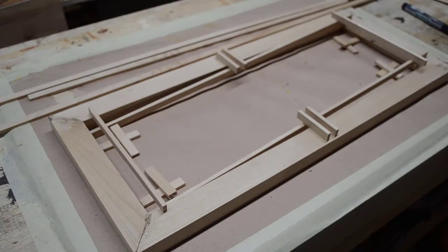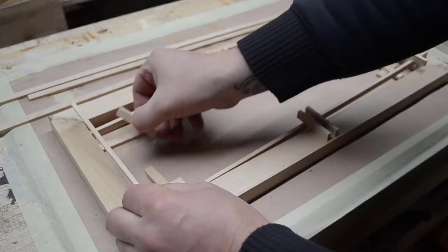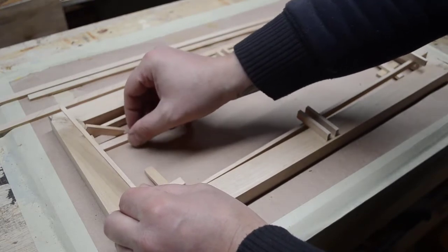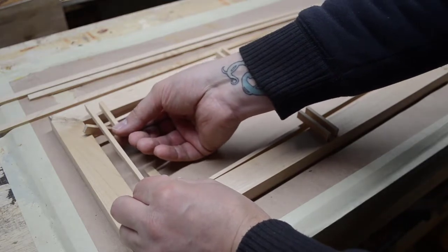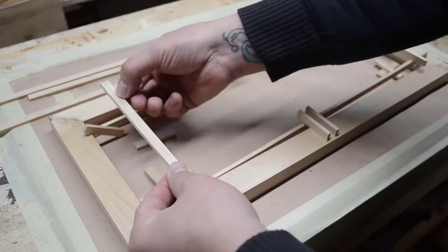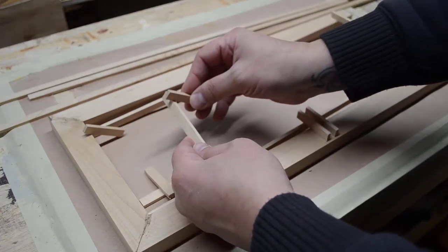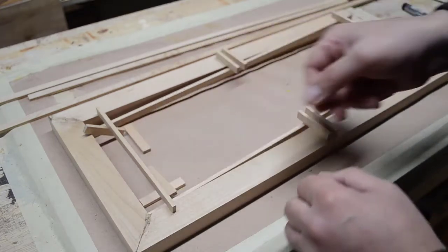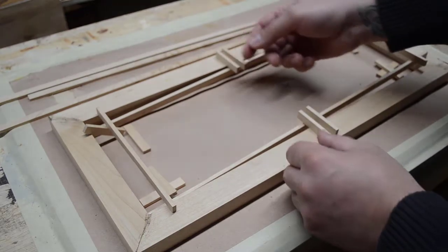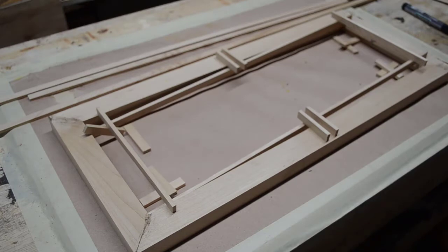The saw leaves a fluffy, coarse edge, which I'll clean up with a hand plane. With all the pieces cut, I can start laying out the pattern and seeing how it looks relative to the frame, and in this case, I decided to shorten a few of the center pieces to work with the white space of the artwork a bit better. Since this is such a small piece, I didn't work out how each piece's interlocking notches will be laid out ahead of time, and instead did it as I developed the pattern. I preferred notching out the tops of all the horizontal parts, so each time it intersects with a vertical one, it will create a visual break, which I felt was needed, as the horizontal pieces echoed the long stretch of the frame, and it felt unbalanced.